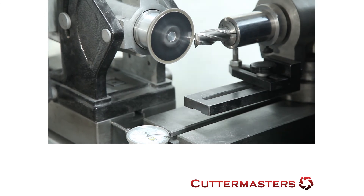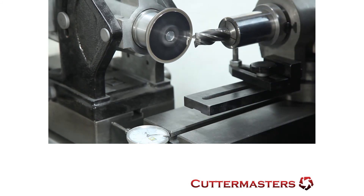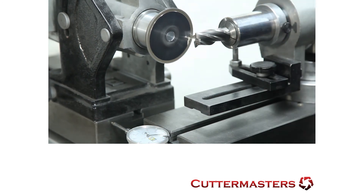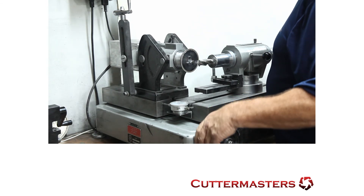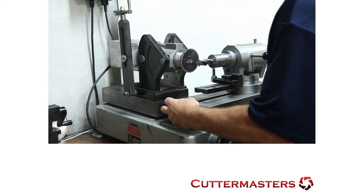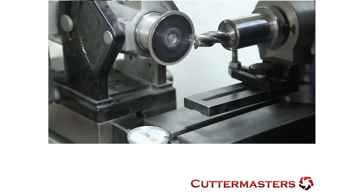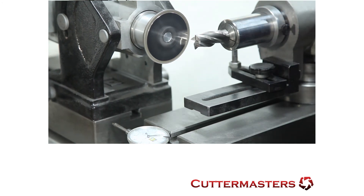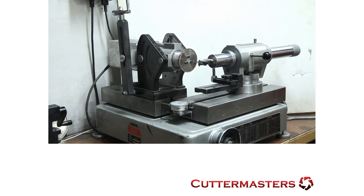Today we have a four-flute setup — it's about a one-inch tool. What we're doing here is finding the center of the tool. We've made it very simple: put this magnetic shelf here, put a dial indicator there, come over and figure out where your center is, set your indicator to zero, and every time you come back just don't go past zero. Instead of trying to dial in the outside diameter, you know where center is. You can reset it when you adjust your air spindle from two degrees to straight.